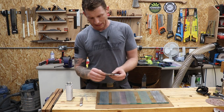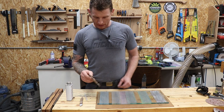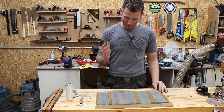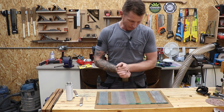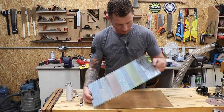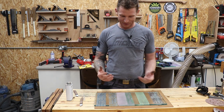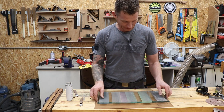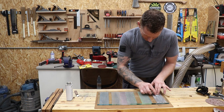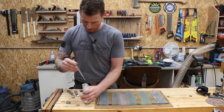I have the knives and handles sanded to 120 grit now — pretty happy with that, they don't need to go any more than that. Once they feel good in hand, that's all that matters. I'm going to put an edge on these using the scary sharp sharpening system — essentially just a piece of float glass with some 3M microfilm on it. It goes from about 100 microns all the way down to something extremely fine — so fine they don't even put ink on the paper as it would change the grit. I'm going to do this by hand, find the bevel, and work through the grits for a consistent edge.